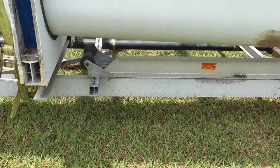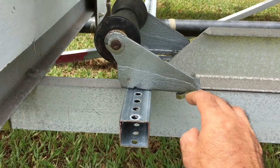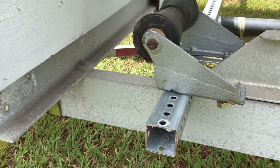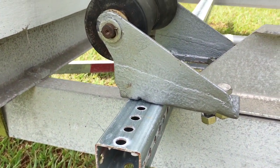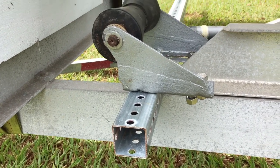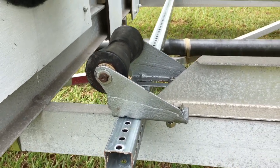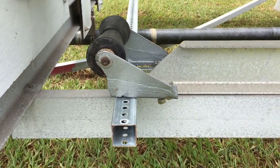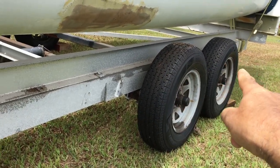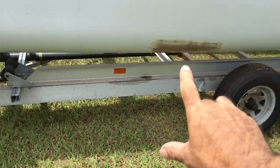Once the U-channel is moved to the outside, I'll remove the cradles and drop down to that new lower level. Then I'll use one of my favorite building materials — galvanized 2x2 street sign posts — because they're available, cheap, and infinitely adjustable. I use these on all my little trailers, underslung with standard roller brackets. You can position the width, reconfigure them, and I've had one trailer work for multiple boats just by moving the rollers. I'll put about six of them along that U-channel to spread the load across the whole length of the frame instead of just at the front and back.